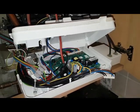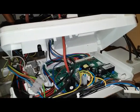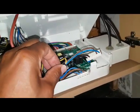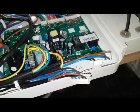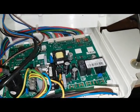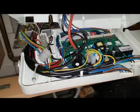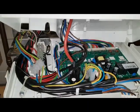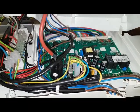Wow, we've got a dead short circuit on something. What I'm doing is a process of elimination. I'll turn the power off. I've traced these cables back to the high voltage and disconnected both of them one by one from the PCB — done one first, tried it, it blew; then done the second one, and it blew. So I'm going to disconnect all the connections from the board and try it again. If it keeps blowing, it must be a dead short circuit on the PCB itself.